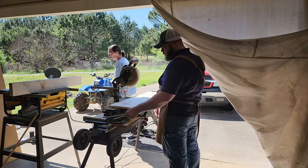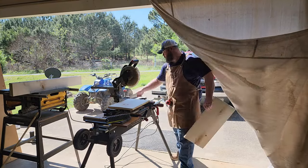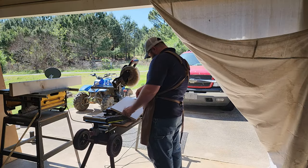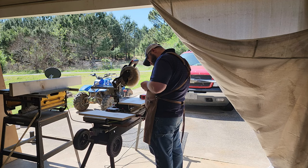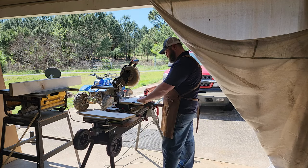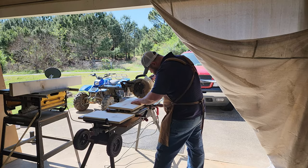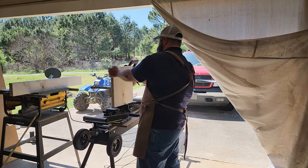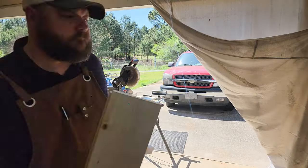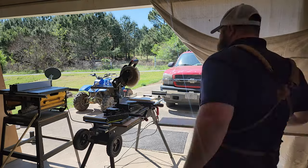Now we're going to go back in — I'm cutting the legs. I need the bench to be 18 inches tall and the wood's three quarter inch, so I cut each leg at 17 and one quarter inches. Then I'll take a speed square, mark three inches in on each side, and run a 25 degree angle on both of them so I can get a little triangle cut at the bottom, making them a little bit fancier.